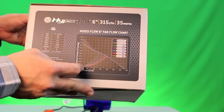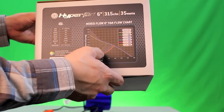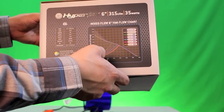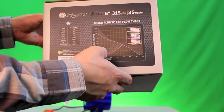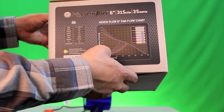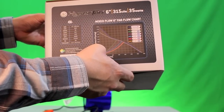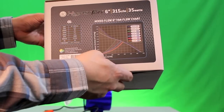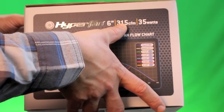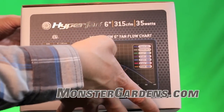Here's a graph showing the 6-inch fan and how it works in conjunction with different filters from Fresh. With the 6x39 inch filter, you'll get a CFM of around 190. With the 6x24 inch filter, about 180 CFM. With the 6x20 inch filter, about 175 CFM. With the 6x16 inch filter, right around 160 CFM. And with the 6x12 inch filter, right around 125 CFM. The 6x39 gives the least decrease in fan output, while the 6x24 is actually the most popular size purchased. The fan is stated to run 315 CFM at 35 watts, but the wattage draw we observed was a bit more — that spec is likely more accurate when the fan is married to some ductwork.